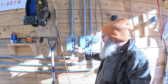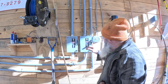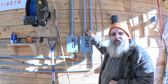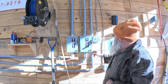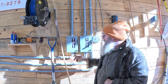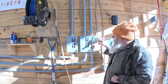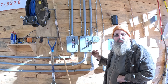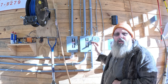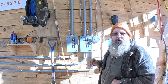These can be used as breaker boxes or switches. If you go looking for a 50-amp-plus switch you'll have a hard time finding one that's not outrageous — I think I got these for $35 to $40 a piece. There's 220 volts coming in here and 220 going out. It goes outside — this is our other switch here; we're pulling one leg off 220 to run that fan. If we don't want it to run we can just turn it off, but 99% of the time it stays on. Anytime we get ready to saw, you'll see Matthew or me walk over here and flip on the exhaust fan.